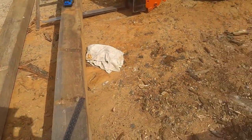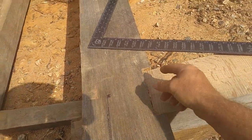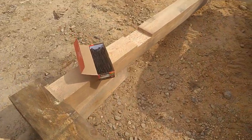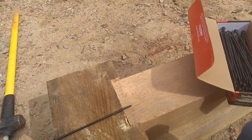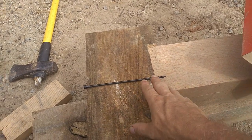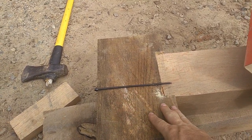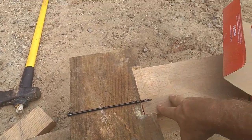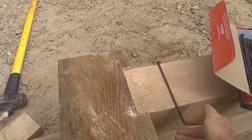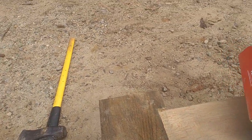beams tying to the 6x6 posts, and I notch everything 1 inch deep, and I'm using timber screws, these timber locks, 8 inches long. So what happens is you get these going in and screwing in. It's not very deep on this 8 inch post or beam. Yeah, boy, I'm having trouble today with beam and post, but it's enough to hold it in. Plus this is locked and everything gets tied in later. But on the 6 inch beams and posts that we'll be using, you get good penetration. Have really good success with these.